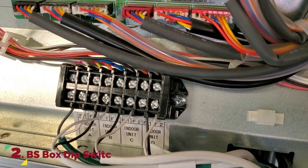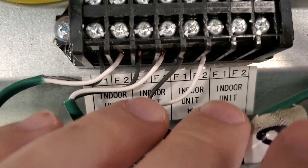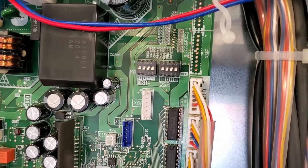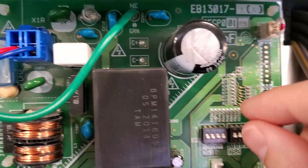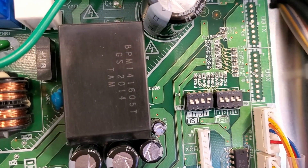Before we power up any equipment, I always recommend double-checking the wiring connections at the branch boxes for any loose wires and making sure you set your dip switches properly. Ports I, J, and K are being used, so L is the only one that's empty. That means dip switches on the left-hand board are all staying off, the middle board is all staying off because we're utilizing all the ports, and on the last box DS1 switch number four goes on — everything else stays off.